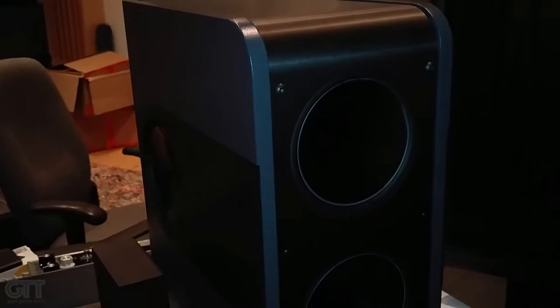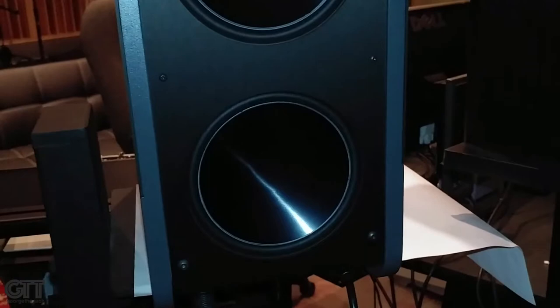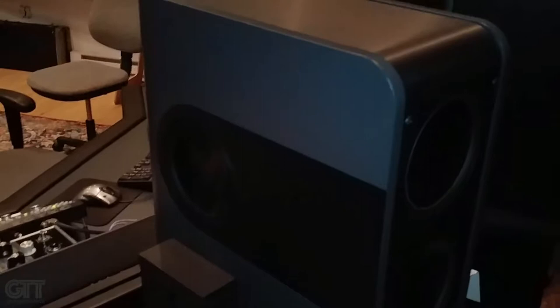Is it in essence steering the sound to the front? It is — it's all through processing. What it does is in a less-than-great listening environment, since there's basically no radiation coming out of the back and sides of the speaker, you eliminate all of that first reflection issue that you'll have in a studio. Even if the speakers are placed right up against the back wall, you don't have any of that first reflection.